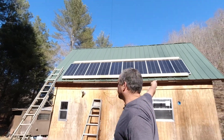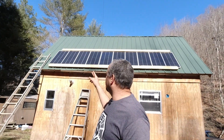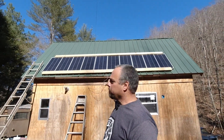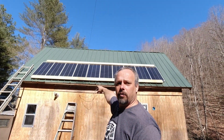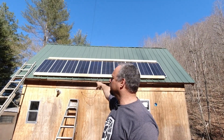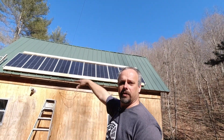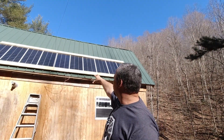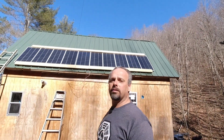The two solar panels on the ends are not even hooked up now - they will be. I'm going to get at least six more so I can have two more circuits of four. But right now I've got four hooked together in series and these other four hooked together in series - not the ones on either end, but the four and four. They go in parallel and come out on those two wires into the charge controller.